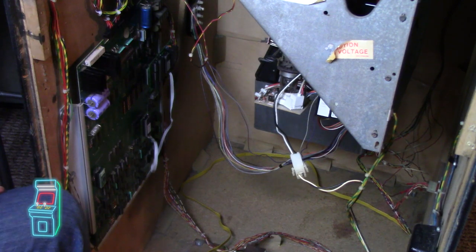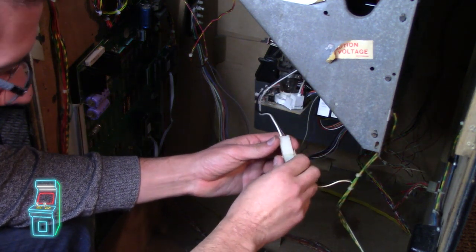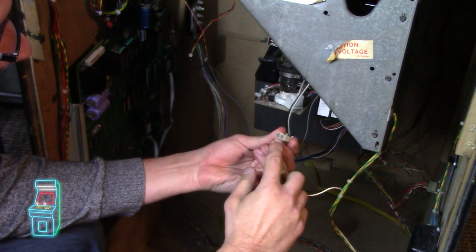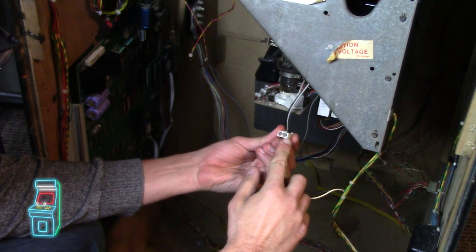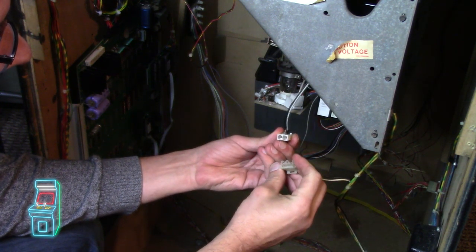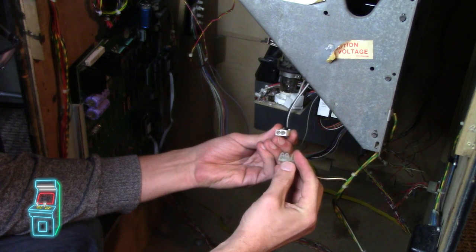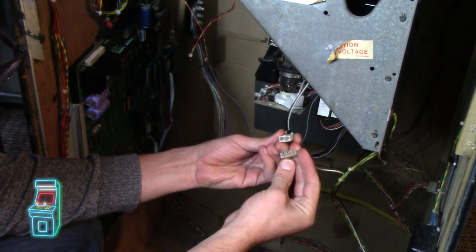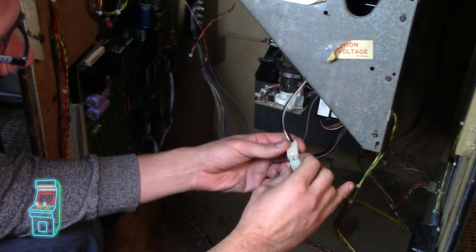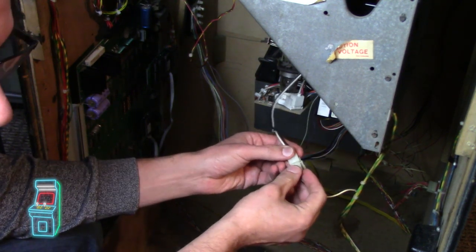Okay guys, so I unplugged the machine, and this here, this is the connector I was talking about. So if you look at it, it has its key to be a circle and like that little U-shaped thing there. And this one here actually has two U-shaped things. So it's totally mismatched. It's not really supposed to go in, and somebody just forced it. And over time, the plastic kind of wore out. And because of that, this is a little loose in here.